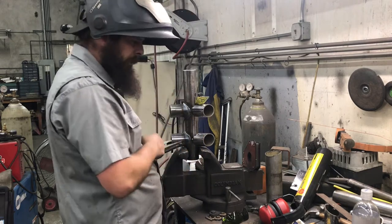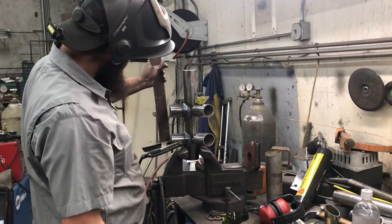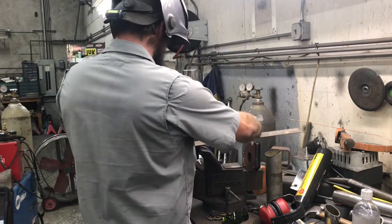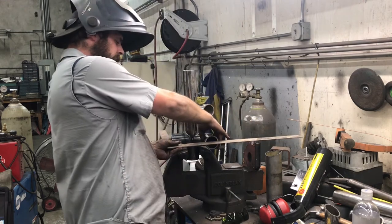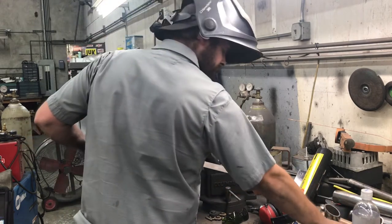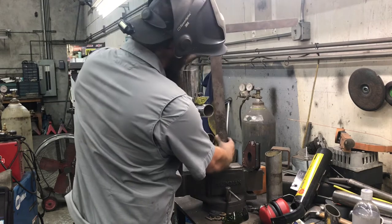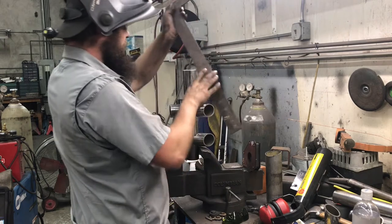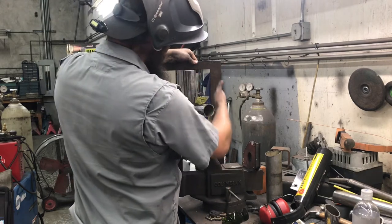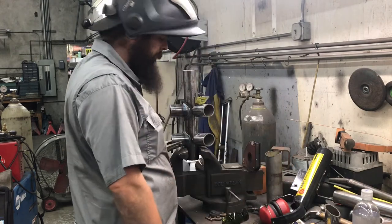Once I have it where I think it needs to be, I go ahead and put my magnet on it. A framing square is so handy when you're doing metal fabrication — you can tell if all your fittings are lined up and everything's square. I already have this one tacked in place. I can take one of my off cuts where it needs to be, square everything up, and make sure that I'm going to turn that corner a perfect 90 degrees. I can do the same thing because I cut all three of my fish mouths the exact same length at the exact same radius. All I have to do to make sure this one is in alignment with the other one is just square up off of the edge. Throw the square across the top — if these are all true cuts and the same length, they're going to wind up nuts on the square every time. Super handy for fabrication. People don't really think about it — it's a carpenter's square — but man, they're handy.